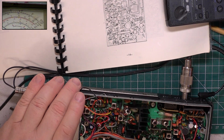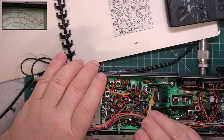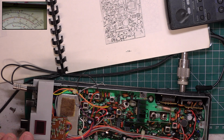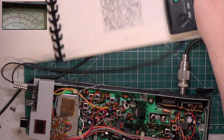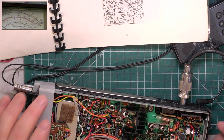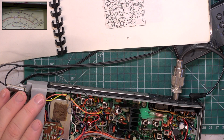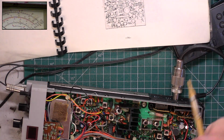And we'll just check the power preset there. So it's at 3.5, and I think that's at full whack. So that's fine, absolutely on the money. So let's look at deviation. You usually end up with these at full, to be honest. On this occasion we're turning it down slightly. So the deviation is VR1.